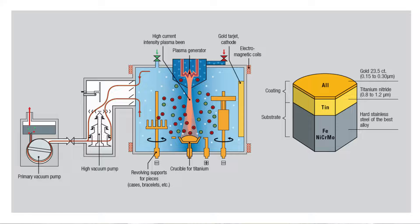Argon gas is then inserted into the chamber. It performs a kind of chemical cleaning of the entire surface, heats up the surface where the coating will be applied, and vaporizes all the micro dirt or even oxidation that may still be on the part. Then the material that will be applied to the surface is vaporized using plasma. The very high temperature of the plasma is capable of vaporizing even solids — even metals or minerals.